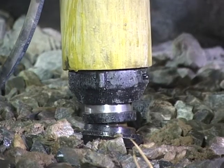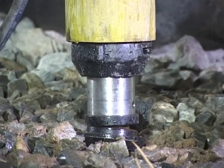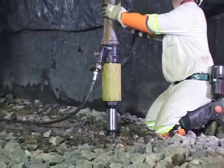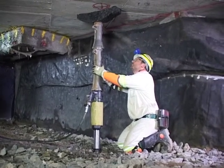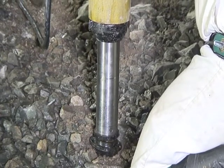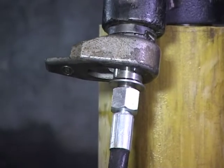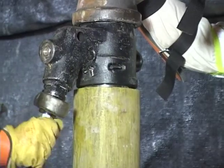Proceed to pump. Keep pumping whilst guiding the prop extensions and load spreader at 90 degrees towards the hanging wall, and align the load spreader to suit fracture orientation. Stop pumping as soon as the load spreader makes firm contact with the roof, then move to a safe and supported area. Continue pumping until the pump stalls. Make safe before removing the filler nozzle.